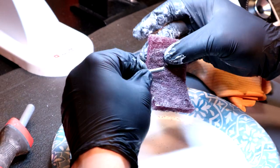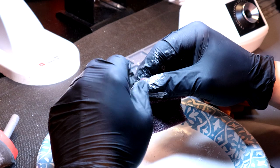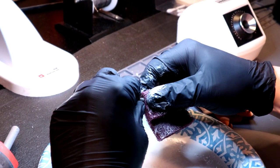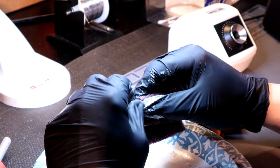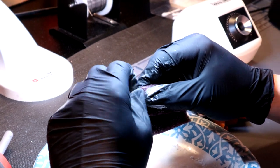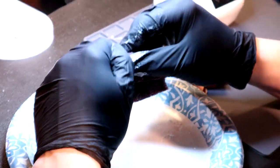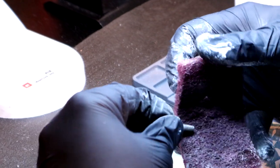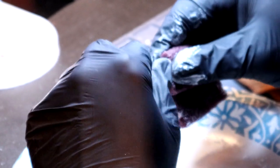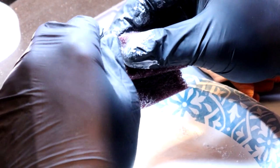You can see that tip coming right back — and this is prior to polishing. When I say polish, we don't want to polish where we're going to apply solder. We want to polish everything we're not applying solder to, so that area stays clean and won't interact with the flux or the solder we'll be applying. You can see just how fast this is — all shot in real time. I'm going to hit the threads as well. As the Scotch-Brite wears it gets thinner, and its ability to return to shape degrades — that's totally normal. Very little pressure, just cleaning the threads lightly.